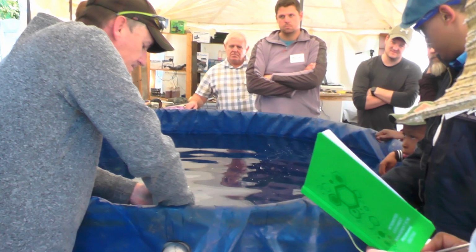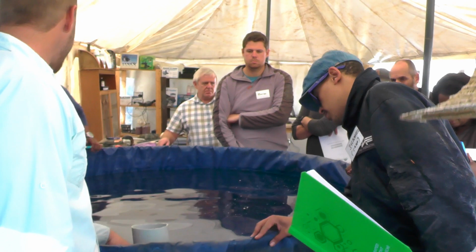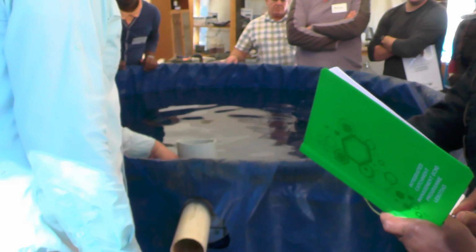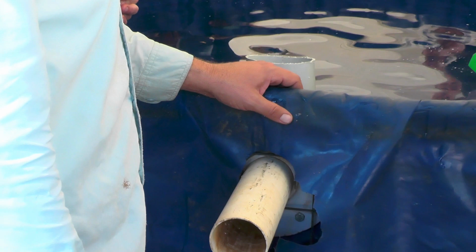How do you get that flange in? The flange, this is PVC pipe. You can see I've done exactly the same with a heat gun. This is flat PVC sheet. With the heat gun, I've cut my hole, heated it, pushed a 75 pipe through, and I've got one on either side of my plastic. Then I bolt it, and I glue it. A flange that cost me 20 bucks, and this can cost you like 300 bucks, for instance.